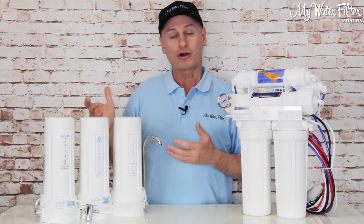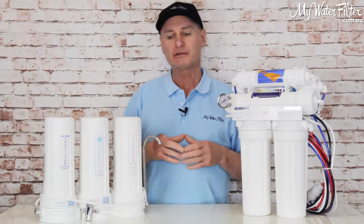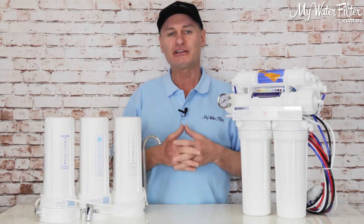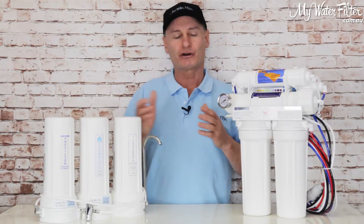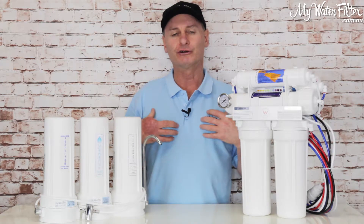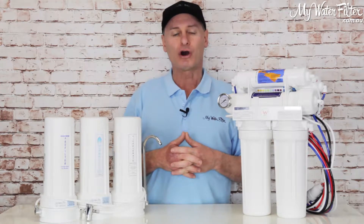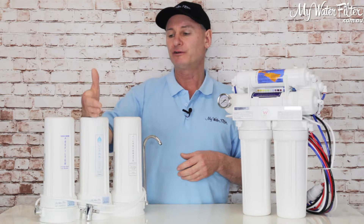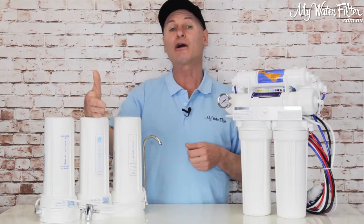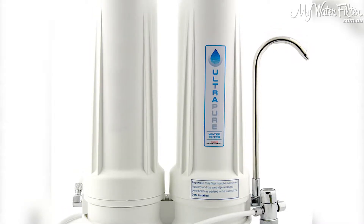If you've got a concrete water tank, the lime tends to leach out of the walls of the concrete and mix with the water, and that'll elevate the acidic rainwater up to a neutral pH around the seven mark. When water's neutral, it's not eating into the copper pipe or attacking home appliances — and it's good for you too. We always want people drinking water higher than seven. So if you've got a concrete tank, you could simply have a pre-filter and a cold stream or ultra-pure water filter — just a twin system — and you'd be good to go.